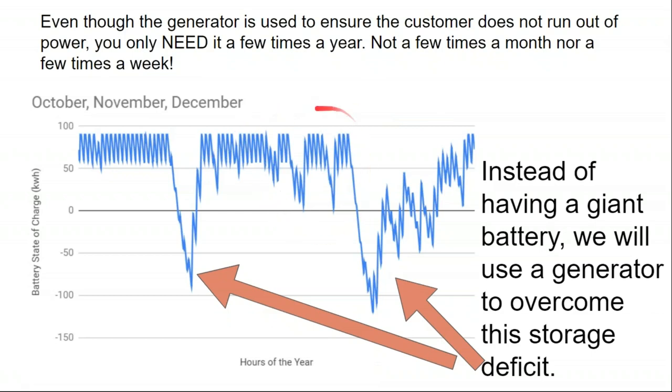Here's another cycle. It's actually one cycle and then another cycle where, if I went with a 90 kilowatt hour battery bank, I'd be draining it all the way down to zero and having to run that generator again to give me a full recharge back up to the top. But then the next few days are sunny. And so I kind of wasted all that gas recharging my battery bank, because if I could have just lasted another day, the sun would have come back out. And that gets into energy management issues and weather predicting.